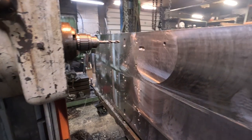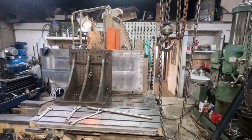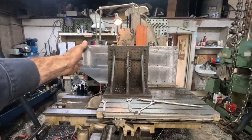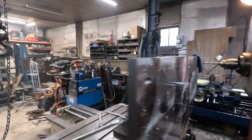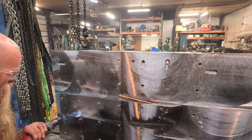Here's where we're at: I've through-drilled all of them that would clear the angle plate - that's 20 of them. Then I've drilled about halfway through the plate on all of them I could reach on this side, which is another 15. I can get just past center, and my theory is that those ones I'll chase on through with the mag drill.